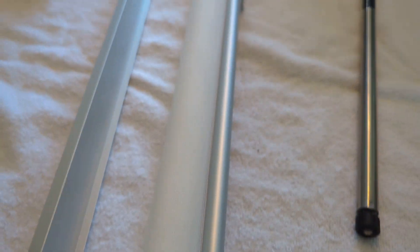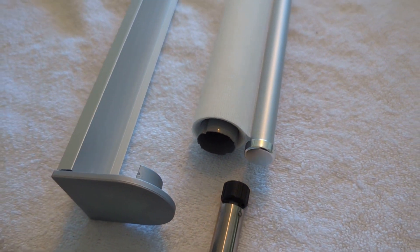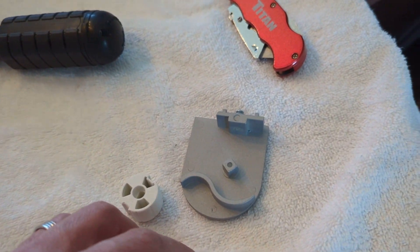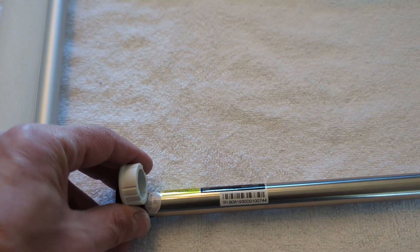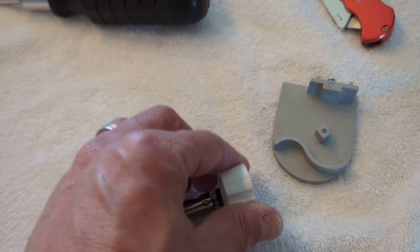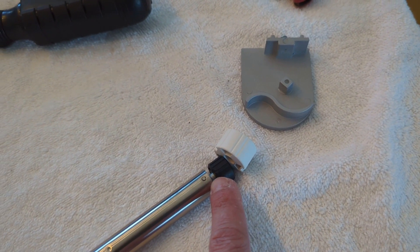The other end is already capped with the freewheeling side. Now I'm going to put the motor in here, but you'll notice the part already mounted on the motor is smaller than the 25 millimeter tube — that's where the adapters come in. I slide the adapter on all the way to the end to make up the difference. This round white part on the inside is actually what drives the shade rod — it turns inside the tube.